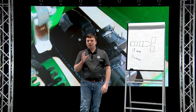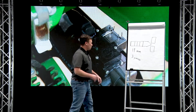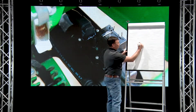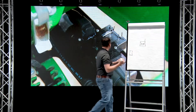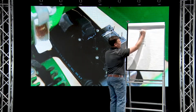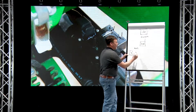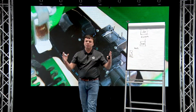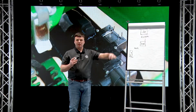We had this question: is it correct that there's no harness to connect Dash to the cab? That's actually correct — we use wireless communication across your planter. We use Wi-Fi to connect the rows to each other through our central hub. At the center of the planter you have the hub with its antenna, which is the master controller, and then each row has its own antenna. We communicate with Wi-Fi from the row antenna to the hub, and then in the cab where you have your iPad charging, we connect using Bluetooth. The hub is powered at the pump tower at the center of the planter, and at the row we connect with a small short harness to pick up power to run the valve and our system. All communication across the long links of the planter is done wirelessly.